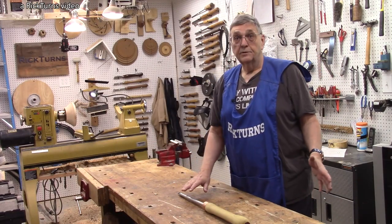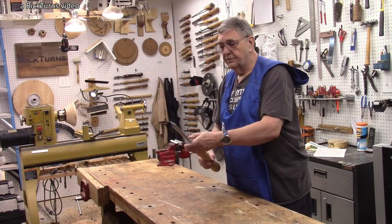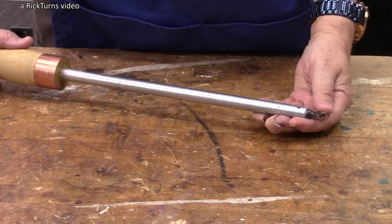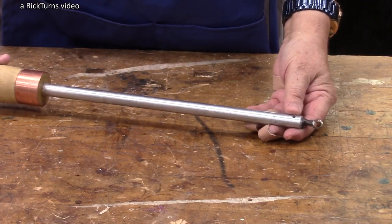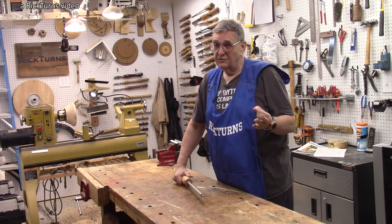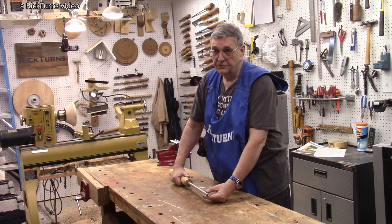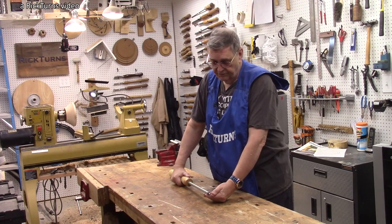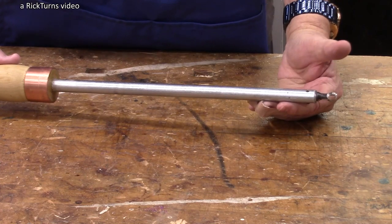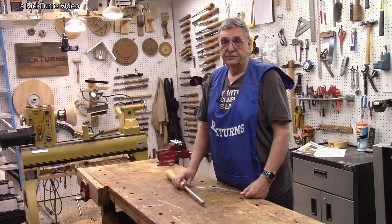I've been tremendously impressed with this. As you might tell from the preceding clips, this little ring cutter — man, it is just great. It's not really good for hogging off a lot of wood; it's more of not quite a finishing tool, it's a little better than that. But it sure does leave a good finish on the wood, even cross grain, which is where I would always get tear out and struggle. My only regret about this tool is I didn't find it years ago. See you in the next video.